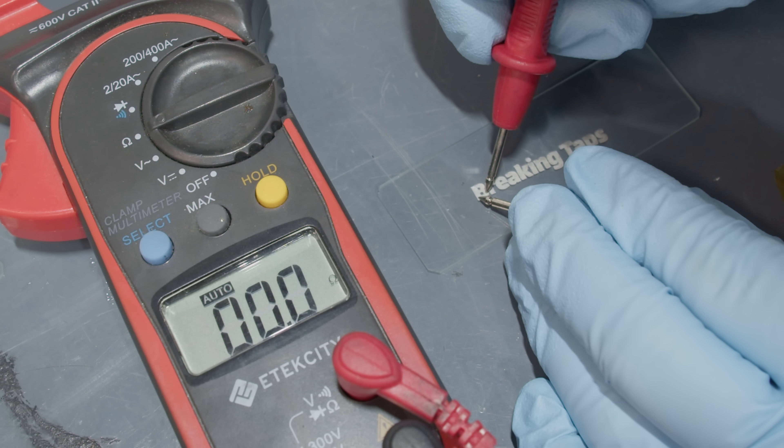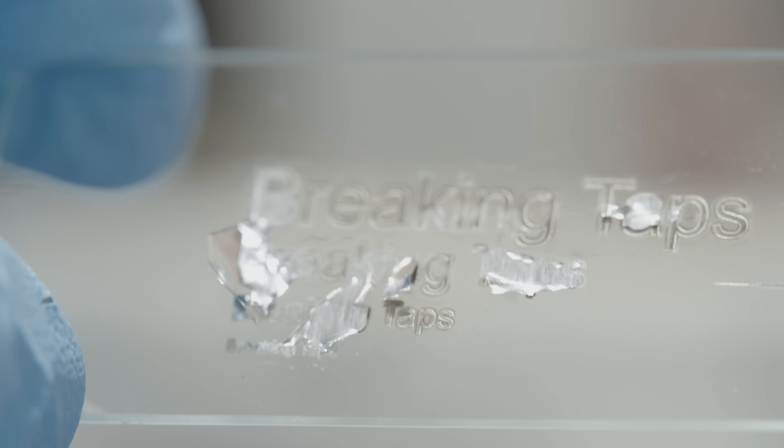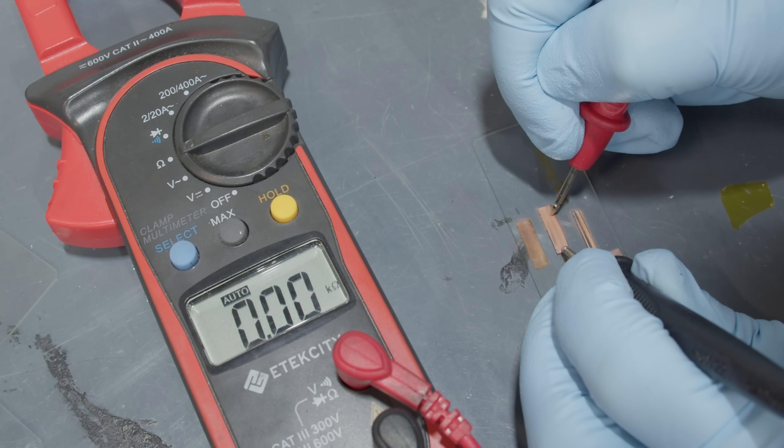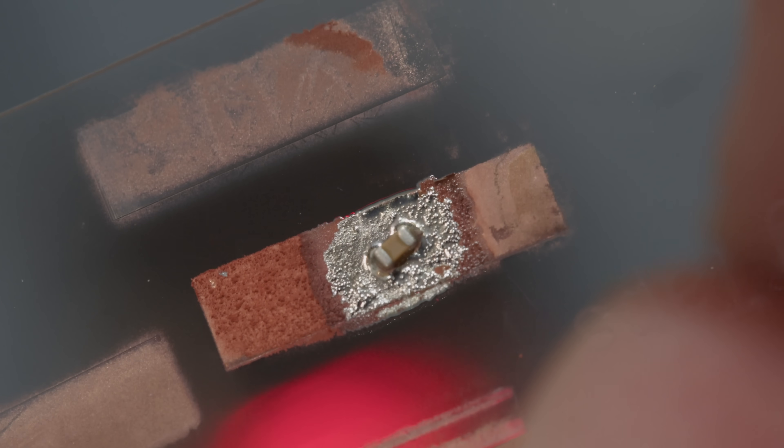I did try zirconium as well but it didn't really work, and we'll see that in a bit. The transferred aluminum is reasonably conductive, and you can even weld large pieces of metal directly to the glass if you're not careful. The copper isn't terribly conductive, but it's conductive enough that you can electroplate a thick layer of copper on top and use that for soldering. Let's take a look at the setup first and then we'll explore the different metals and their properties.